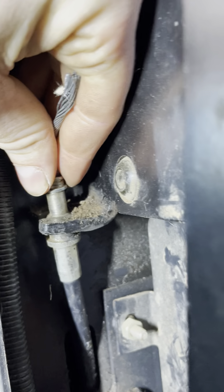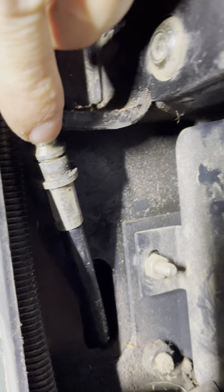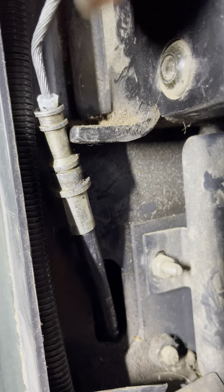You then have one of these little split washers that holds the clutch cable in there, so that fits up from the bottom — you had to tap it out with a hammer. When that comes up, see that little groove there? That clip sits in that groove over the top, which obviously stops the cable travelling down.